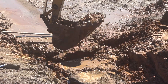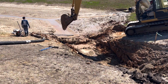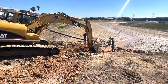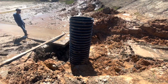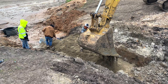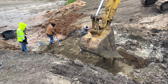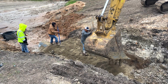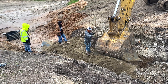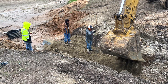Here you can see we got down below — we're dipping it out. We're going to set a pipe in here and put stone around it. That'll let the water come in to a lower level and we'll pump out of that. Here's the pipe — we drilled a bunch of holes into it so water would come in. It's below grade, going down. We're sucking water about three feet lower than where we're working. The pipe has bull rock around it, drilled holes in it, so the water's leaching into the pipe and the pump is constantly pumping it out.